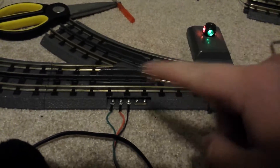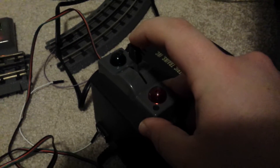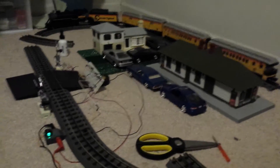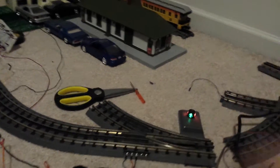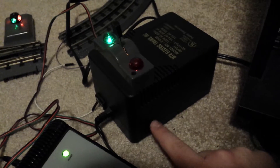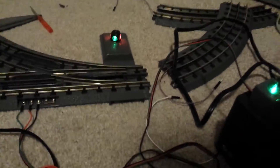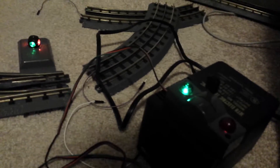All that current charged up by the capacitor discharges directly back into this switch. You can see now it's completely clean with no flickering, but it was causing an enormous short circuit around the track — the engine would stop and actually reverse directions, cutting off current completely. It would cause the transformer to overload on current. It turns out it was the giant capacitor discharging everything back into the switch, and sparks would actually fly out the top of this thing if you held it long enough.